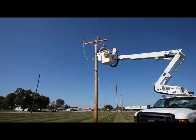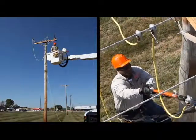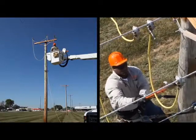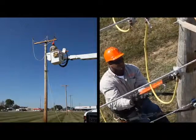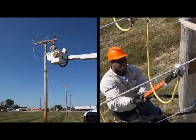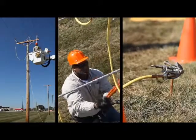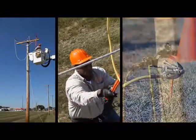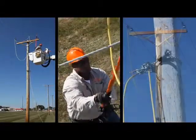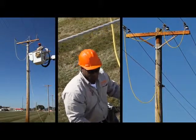Of course, the very same methods can be applied just as well from an insulated bucket truck. Whether the work is done from the pole or out of an insulated bucket truck, the same dual point or single point method must be used to provide an equal potential zone of protection for the lineman. Whatever your work practices, either the dual point or the single point method establishes an effective personal protective zone for de-energized construction or maintenance work.